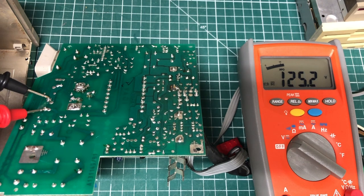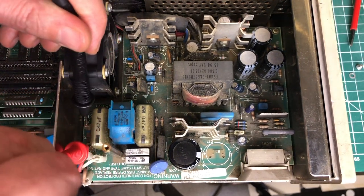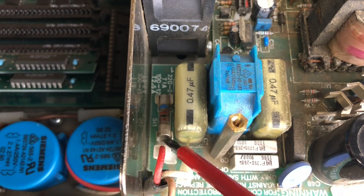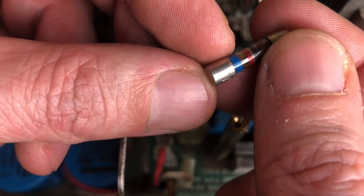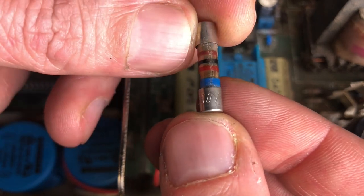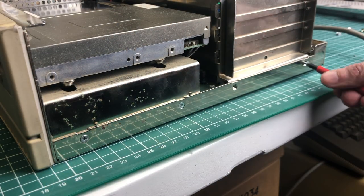It takes a very long time for the capacitor to fully discharge. The first thing we want to do is check the fuse. A continuity test shows it doesn't beep, confirming the fuse has blown. When we pull it out we can see it has exploded — the wire is gone, indicating a violent short. This was a 1 amp fuse. With a new fuse installed, as soon as we hit power, the fuse blows again, so we need to dig deeper.